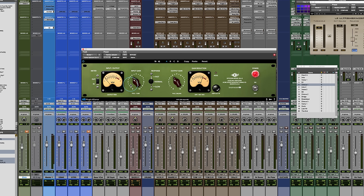And that's obviously for broadcast purposes, where there is a sort of gap. You don't want the gain to make up too quickly. This way, if it's an announcer at a baseball game and they don't comment too quickly between pitches, the gain doesn't make up all the way, and then all of a sudden you hear all kinds of noise in the background. Here, this is not really the use for that, but you could hear the edgy character that immediately comes in. So let's go to a softer setting.